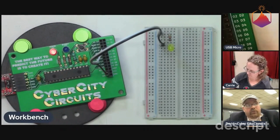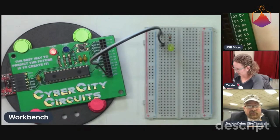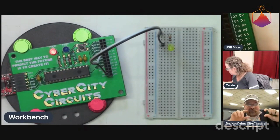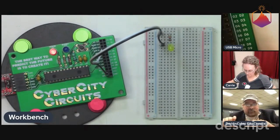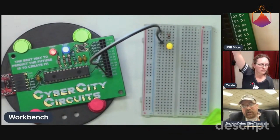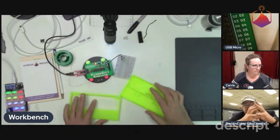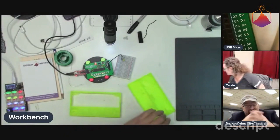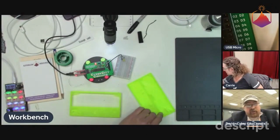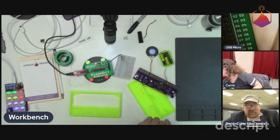0805 is really nice. When you're doing KiCad, there's an option for hand solder pads. There's R0603, and then there's R0603 hand solder. Use the hand solder stuff. It's going to make your life a lot easier for rework, if you can get away with it. Now, if it's a really tight, constrained design, maybe not. But they're not that much bigger. They don't take up that much more space, and it makes everybody's life easier.